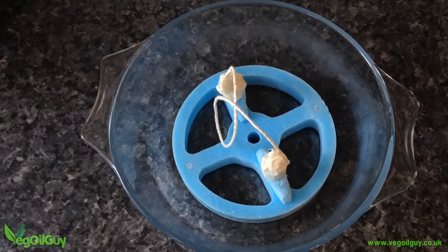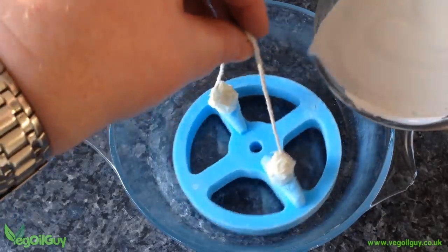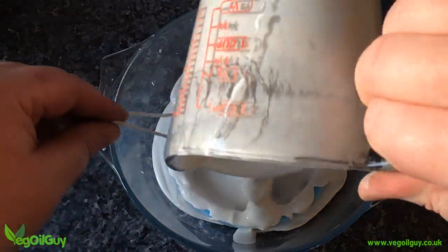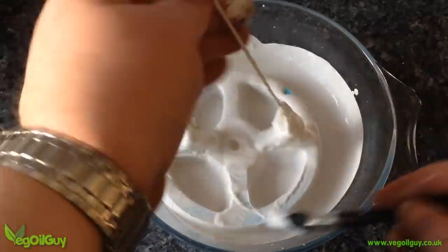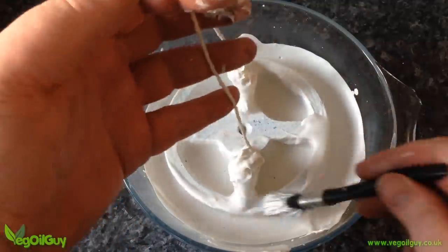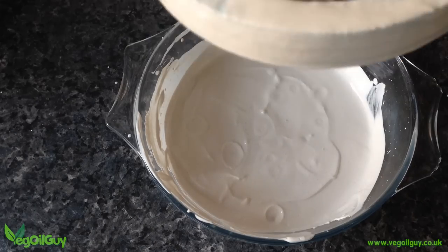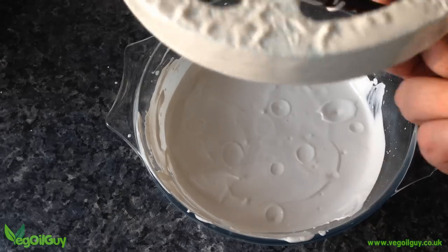Not wanting to be too wasteful with the plaster of Paris, rather than mix up a dip load, I placed the foam pattern in a container and poured on a fairly watery mix. I took a small brush and worked the plaster all over the pattern, making sure everything got covered. I then thinned this out as best I could and hung the pattern up to dry. You can tell I'm using the brush to thin the plaster from the bottom of the pattern — hence the drips.